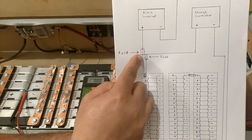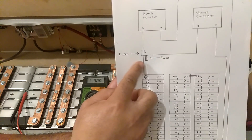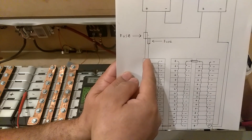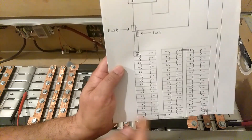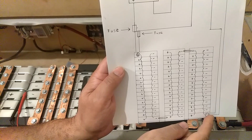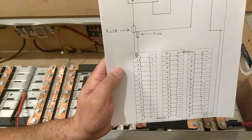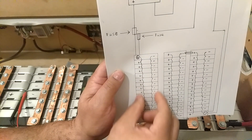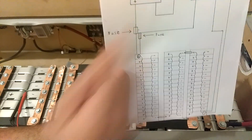Your inverter needs a fuse — you're going to have to fuse it at the battery, as close to the battery as possible. You want to fuse it so in case something happens, it'll blow that fuse and kill the power coming out of the battery. You need six bus bars on the batteries going from one end to the other, and then two cross bus bars. The reason you hook your ground and positive at opposite ends is because it makes the current flow across all the batteries — through all the way across these, over, across these again, and then out to your inverter and charge controller. I think that helps the battery stay more in balance.